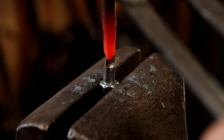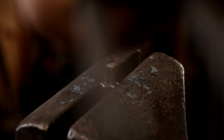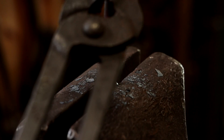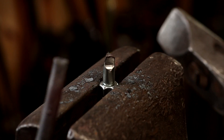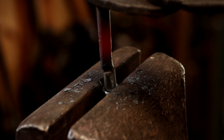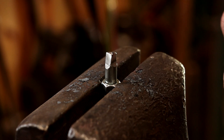I want to see if I can get that to drive over the bolt here. It's still a little bit too big — we're going to have to sneak up on it. I'm kind of driving it one corner at a time to see if I can get it to push over. A triangular tapered punch would probably be the way to go here. Tapering the end of this a little bit more might help. Now this one from the previous lock is a bit smaller, so I'm going to use that to kind of start opening this up. Now this is not perfectly symmetrical, so you have to pay attention to what it looks like and make sure you put the key on the same way every time.